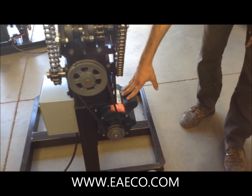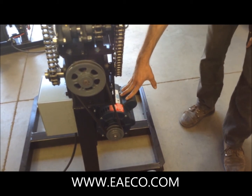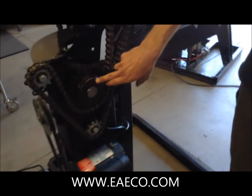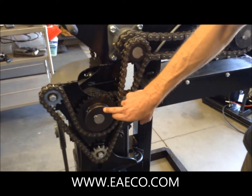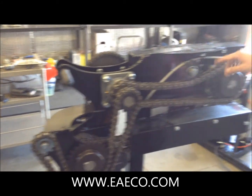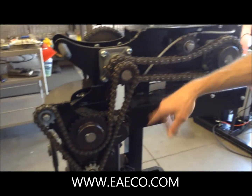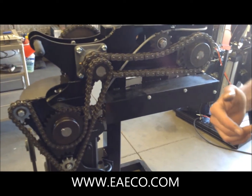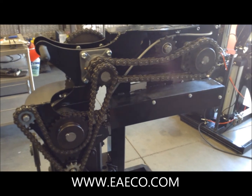This is the same motor that's on the truck tire sidewall remover that you have. This is the reversing shaft, and what this does is it takes the rotation coming from the gear box for the drive wheel and reverses the rotation so that the blade is also driven to help assist feeding the tread through the machine.